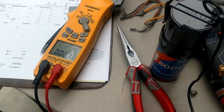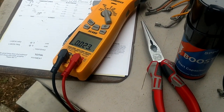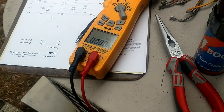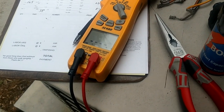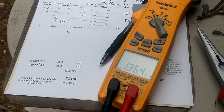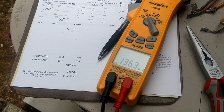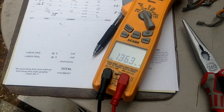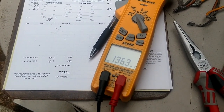So we're just going to hook this thing up here. If I can get everything into one shot, you'll see how quick it is if we can clamp this on here — I may or may not be able to do it with one hand. Okay, there it is, and there's the reading. Run capacitors are even faster than that. That just took like an extra second because it is a much higher microfarad. But we're reading 136 on this one.